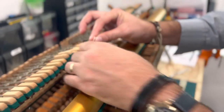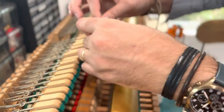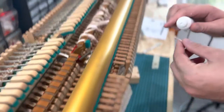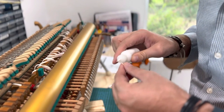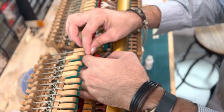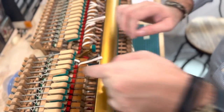You're going to put it flush with the round part — up to the back of the round part of the hammer butt. We're going to put it on with our finger. Sometimes you need to put another bit of glue on because it gets sucked up. Put it on the back here and then leave it to dry. Make sure it's flush, and leave it to dry.